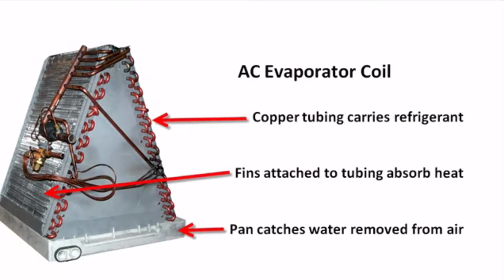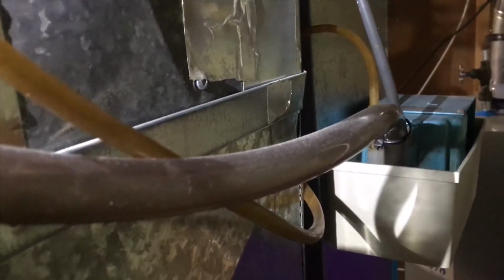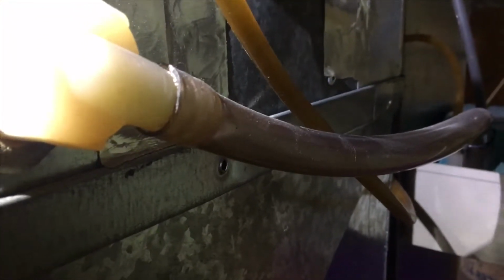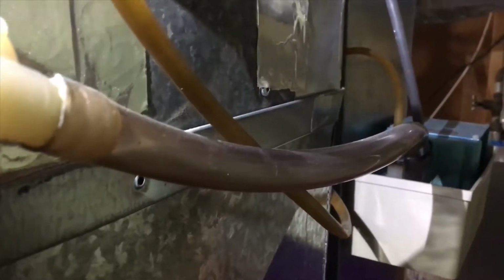And as well as your condensate line here. Inside here, there's an A coil. And for your air conditioning, what happens is there's a tray underneath that collects the water, and it comes down here all the way down until you get to your condensate pump there, and it gets pumped out. I was at my father-in-law's this weekend, and his was clogged, and the water was dripping all the way down the side of the furnace cabinet. Hopefully there was no damage inside there, but you want to make sure that you clean those out at least once a year as well. Just put some warm water and some soap, clean it out. Or even if it's pretty old and brittle, go to Home Depot or Lowe's or Canadian Tire and get some new stuff.